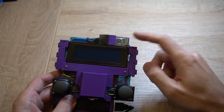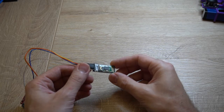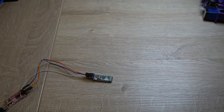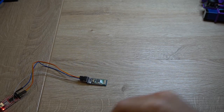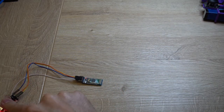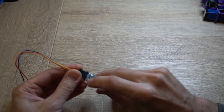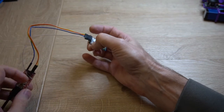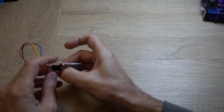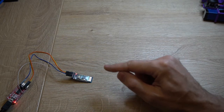Let's talk a little bit about the Bluetooth adapter used in the remote control. This adapter can operate in two different modes. The first mode is data mode and the other is AT command mode. If we power on the Bluetooth adapter it will go to data mode, indicated by a fast blinking red LED. But we can switch it to command mode by pressing this tiny push button while holding it during power on. The LED then blinks rarely, indicating the adapter is in AT command mode.